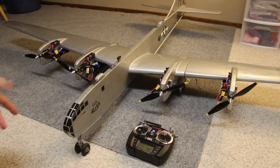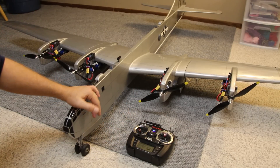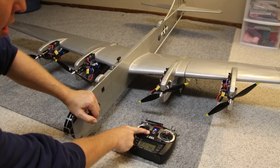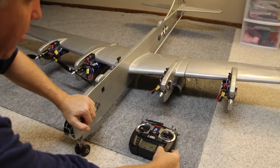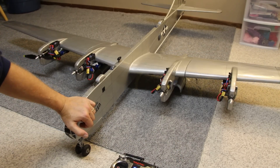Normally if you just had all four speed controls hooked up to the receiver and moved the throttle stick, all four would start. Take the trim switch and move it all the way up — now that one starts. The timer is in control, controlling everything right now. Now they're all started. That transition you hear is giving control back to the receiver.